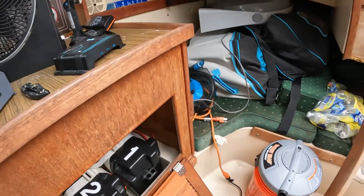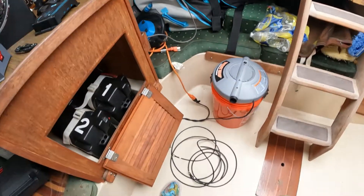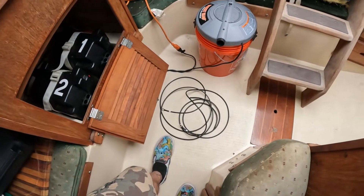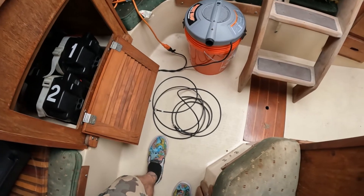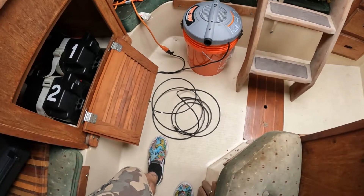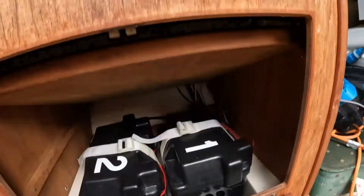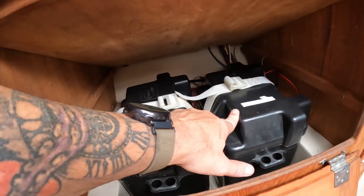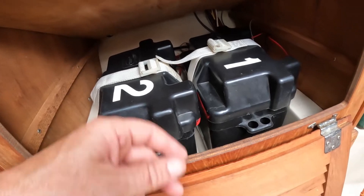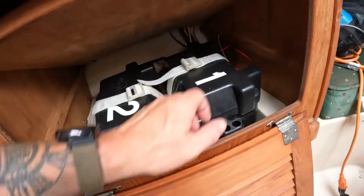But first we have to drill a hole. I'm going to temporarily put the controller up to see where I want it, then drill the hole and reconnect these to the batteries. These generally come on and off depending on if I'm using solar — so if we go over to Croton for a day or an afternoon, I'll connect the panel, run the wires right through here, and put the panel up so we can keep the radio and everything going for the entire day. The problem with this boat right now is even though I have a battery selector, both of these batteries were tied together. I just need to run new cables out to the starter and I can isolate from there. Here they are — we have them zip-tied back there.